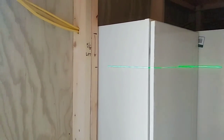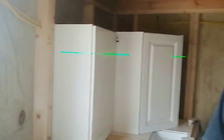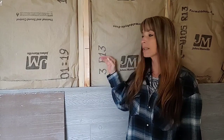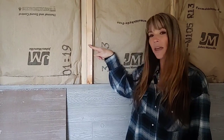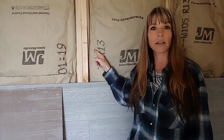We're going to come back tomorrow and begin digging some square footings underneath and putting some screw jacks in to really help support this building. Let me explain how Chris got to the levels he needed. When he set that laser up, it's a DeWalt self-leveling laser, so it shot a green line all the way around the building. Chris went around and marked where that green line was — in this case, from floor to green line it was 54½ inches.